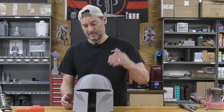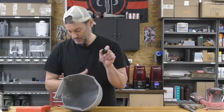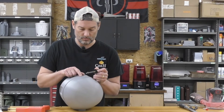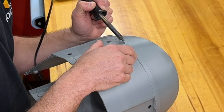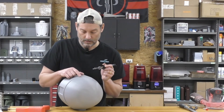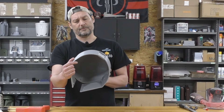Since this is one of my helmets that I'm going to be refinishing for another project, I'm going to go one extra step and simply take my soldering iron — this is the soldering iron I use specifically only for plastic. I'm going to take care of this seam a little better and just come across it with the soldering iron to make sure it's nice and smoothed out. Then I'm going to take my sander and knock that down so I can fill it with a little bit of Bondo. Quick easy fix.